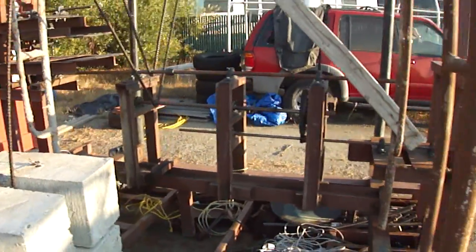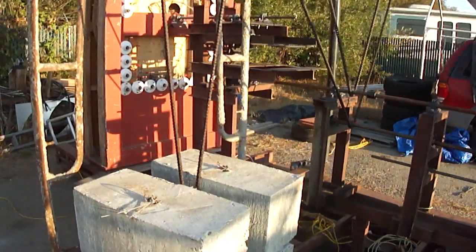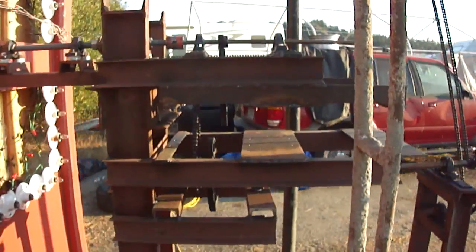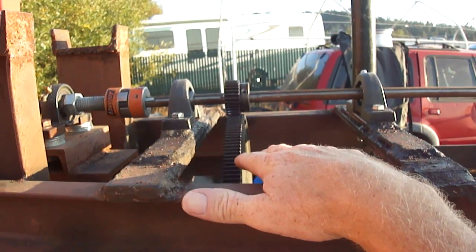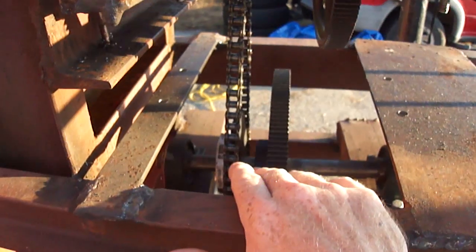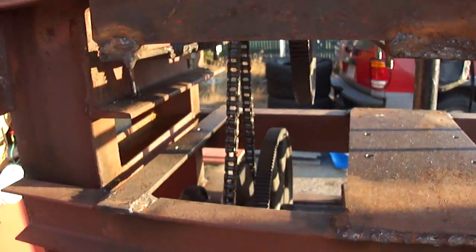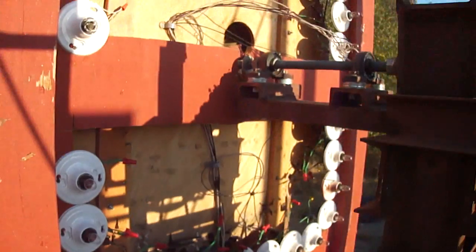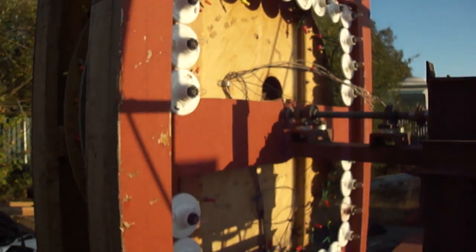The wheel that we just turned works as the winch, and then as the weights fall it runs through a generator gearbox right here. Geared down so that it operates in time with the winch, and then reduced again by about 5 to 7 times off this chain cog right here, so that it slows the generator down more and makes it more reasonable to work with, as it starts to spin with way too much force and speed.